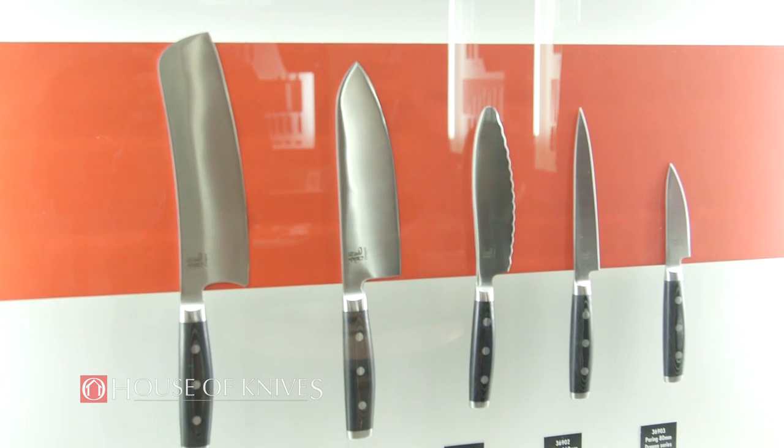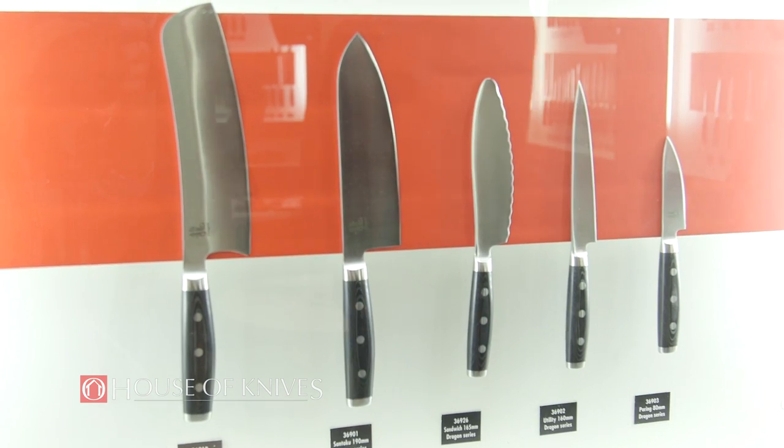A lot of people associate Japanese knives with extremely sharp angles. How are these sharpened compared to European knives? This steel allows us to put a 16-degree convex edge on, which is basically the traditional Japanese edge that's then stropped on one side with a leather wheel. The difference between this and the layered steel knives is that the entire edge is supported by 3 millimeters of stock. So out of the box, the layered steel knife may be a little sharper, but in two weeks this is going to maintain its sharpness for a much longer period because the edge is being supported. Normal stainless steel — say a 400 series — you can't put that type of edge on the knife; it simply doesn't have the strength to support it. You needed a carbon steel knife.